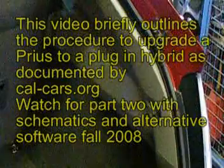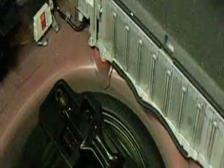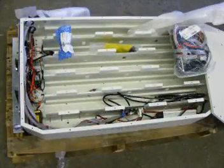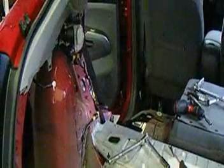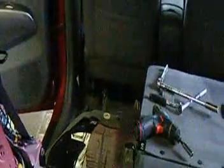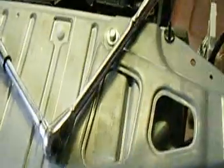We will be removing the plastic and the back seats to gain access to the high-voltage battery. We'll be adding a box on top of this spare tire. It's been five minutes or so — remarkably quick. We've removed the left carpet, the bench seat, the left rear seat, all to gain access to these bolts so that we can get to the high-voltage battery connections.